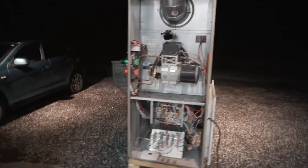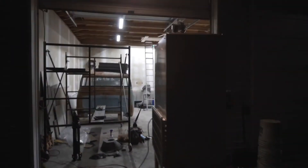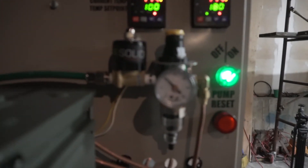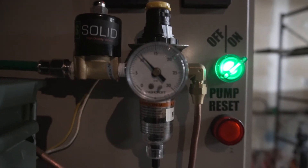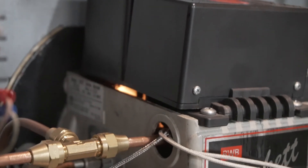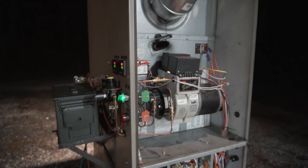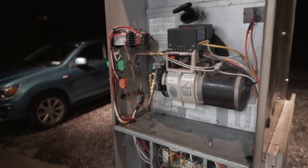Quick walk-around: the burner is on and running, the fan is blowing warm air out the top, and the pump is cycling on and off filling up the siphon tank. I was running 15 PSI during the initial fire-up and it kept blowing itself out, so I've dialed it back to around 10-11 PSI — it seems to fire up reliably at that pressure. I'm going to keep running it, see how much oil I can push through it, let it warm up and cycle the thermostat. If you have questions, leave a comment — I can do another video breaking down the parts and wiring.